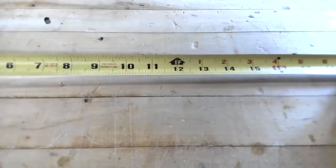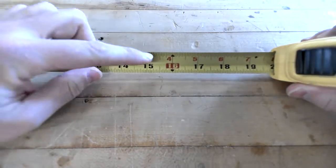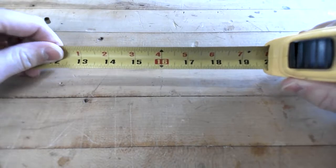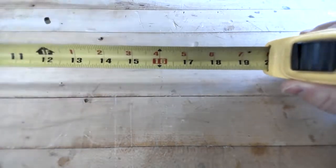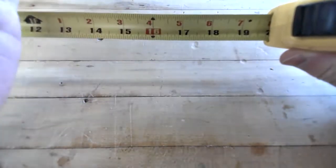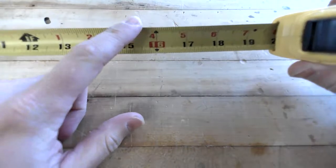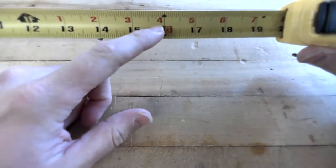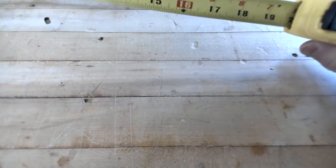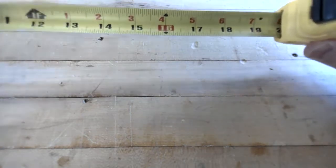What these mean is this is going to help you out with building code. This is 16 inches, so every one of those red squares is 16 inches apart. So this one was 16, the other one was 32, and they're all 16 inches apart from there on out. Now, that is the most commonly used building code, spacing them out at 16 inches. You can do it at 2 feet, but mostly people do it at 16 inches.